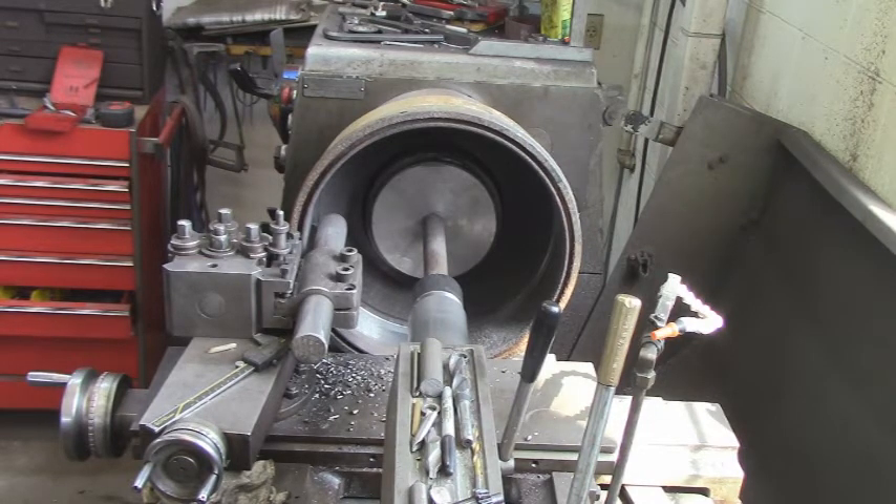My live center would normally fit into it directly — I'll show it to you a little closer later. As you can see, I've got a chunk of drilled shaft propped between the whole mechanism. This would probably work better if you pushed directly without that shaft. Another option I was thinking about would be to run a bolt right through my headstock to the other end of the lathe and cinch it down with an extended piece of rod.